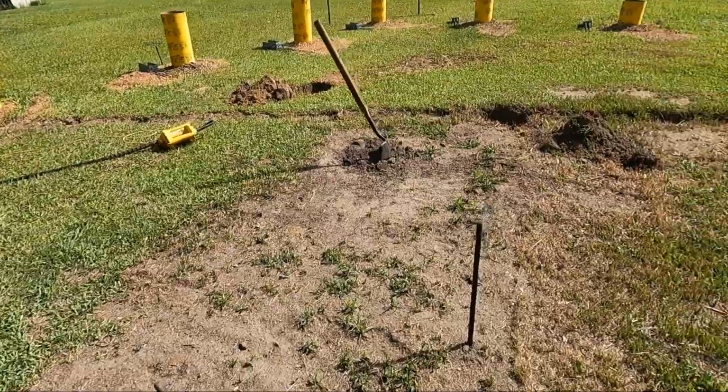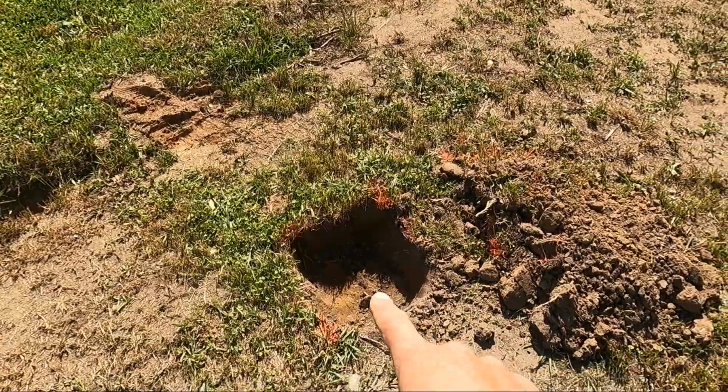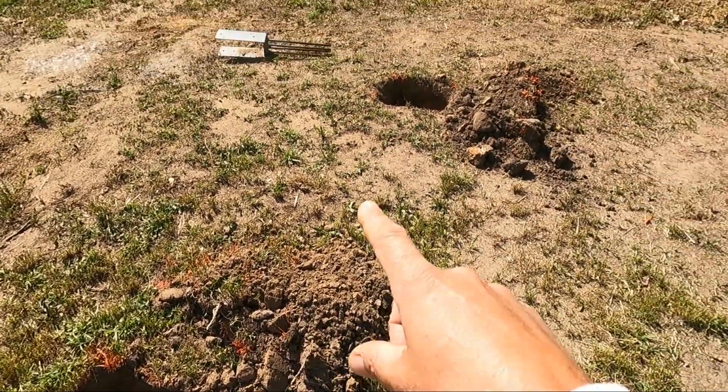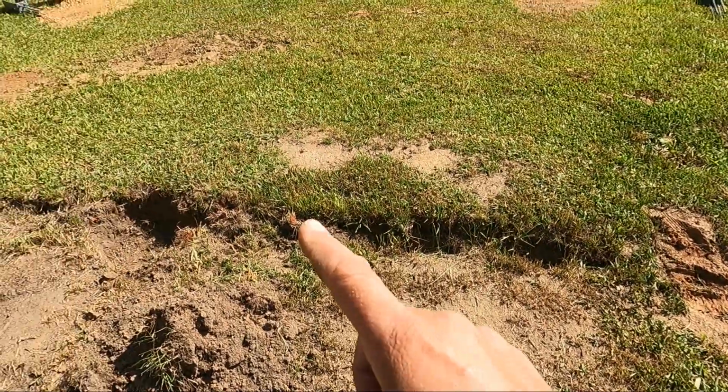Yesterday we dug out some 12 by 12 by 6-inch deep spots, because if there's extra concrete in the truck, we want to fill these up, and that will be the pads that we will use for the pony wall. We're going to put a pony wall down the middle of this build. That was something that I never did say for sure, is this is not getting a concrete floor. I might have said it, but we're putting a wooden floor in here. So down the center of it, we need a pony wall to hold up the floor joists.